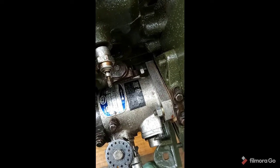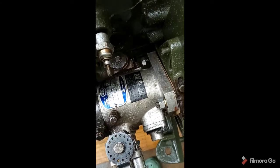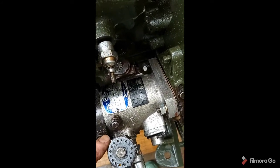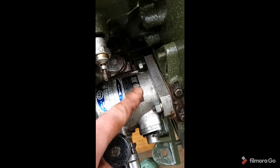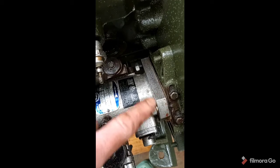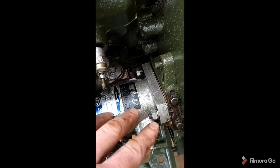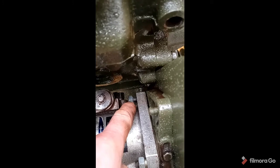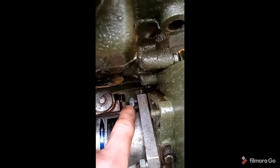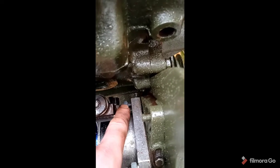Okay, in the case of this one then, this was the evil stepchild that no one wants. So it took a bit of wrestling with this one, obviously not having the factory tools that I mentioned earlier. So what we've done is we've guided it on, we've managed to get it with a torsion bar, and get the pump to draw itself in. We've left enough clearance to get this little badger down here, this 5/8 bolt, just biting on there now, because there's no clearance between that and this item here. So it's on there now.